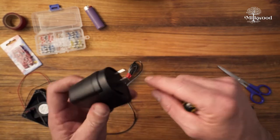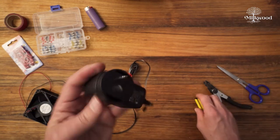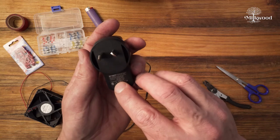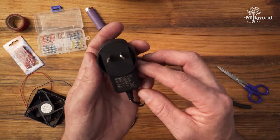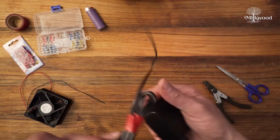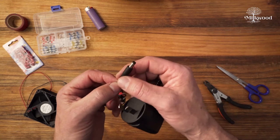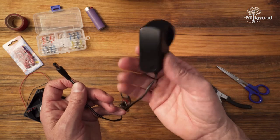In your country you may have different plugs on the end — don't worry about that. As long as it works for your mains power, that's fine. Before we do any work on this, make sure it's unplugged from the mains power. We are working with very low voltage, very low power devices. In Australia, mains power can put out 240 volts at 10 amps — that's 2,400 watts. This adapter outputs only 1 amp at 12 volts, so just 12 watts. That's why it's safe and legal for people to do wiring at low voltage — it can output only 1/20th the energy of mains. Still, you do want to unplug it so you don't short out the positive and negative wires, which could heat them up or break the plug pack.